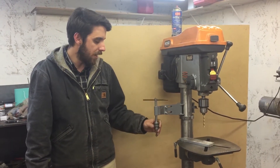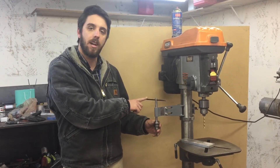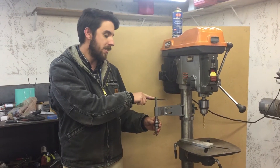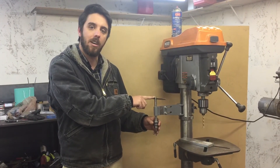It uses a 3/8 key chuck to hold the tap. It has a T-handle so that you can apply torque to twist the tap into the hole. That's held on by a set screw so you can move the handle over for more torque, and there's a hex on the top that enables you to use a power drill if you want to power tap.